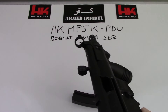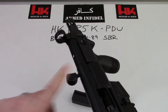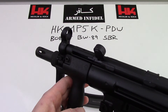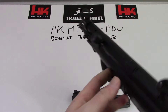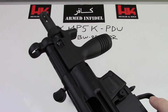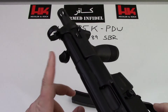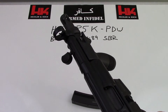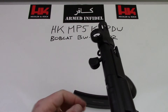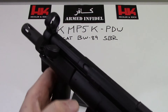One thing for the record — I always see people do the H&K slap, where they slap their hand forward and slap the bolt group forward. For those of you who are in the know, people that do the H&K slap probably don't know a whole lot about H&Ks. Yes, the gun likes to be handled roughly, but not that roughly. The way they used to teach it in H&K sub-gun school is to take the palm of your hand and simply roll it across there and let the bolt fall forward naturally under the recoil spring. If you do the old karate chop on it, you're going to wear out that lug right there and slam the bottom of the charging handle into this area right here. It's completely unnecessary.